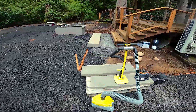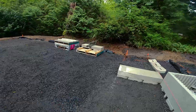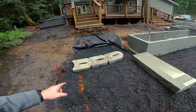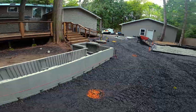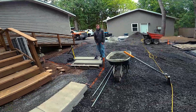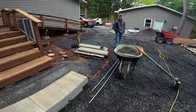Right now we're getting these pavers set in our landings and getting this last tread set over here. Waiting for Seth to get back with some screed material for the rest of these landings. While he's gone, I'm going to get our U-starts set and bring the excavator over to set this last tread. We brought our paver sucker vacuum backpack — these pavers weigh 150 pounds each. It's not effortless, but it makes it a lot easier to lift them, especially with two people — one on the vacuum, one on the Grabo.